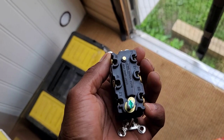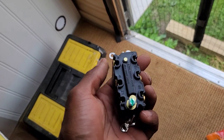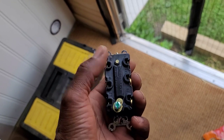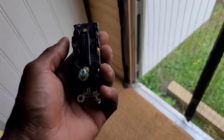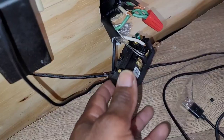As far as the labeling: the load is L1 and it switches between B1 and A1. The neutral is L2 and it switches between B2 and A2, or vice versa. As far as which terminal gets the hot and which gets the neutral, it doesn't make a difference. Let's go ahead and wire it up.